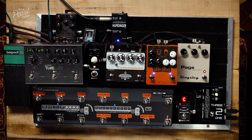Again, another way to tell is the sound of one amp kind of goes away. Which is what happened there. So where I'm sat, all I could then hear was the Turok, and I couldn't hear the Softec, which means it's probably out of phase. Right. There you go. Should be conclusive, I would have thought.